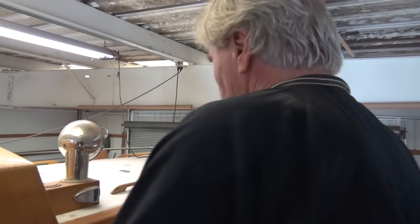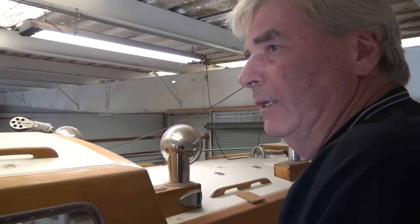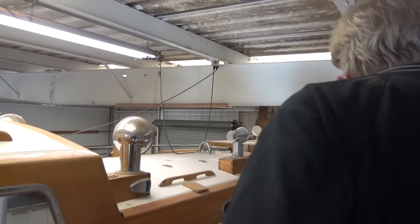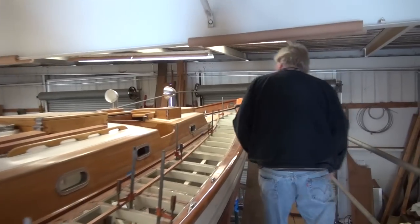Is that going to be a different color than the rest? No. See the color of that teak? That was only cut like an hour ago. Tomorrow it'll be orange, and then as it oxidizes it'll change to its final color. But when you rip teak, a lot of times it turns out green looking on the inside.